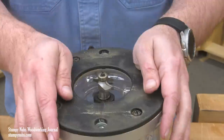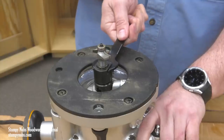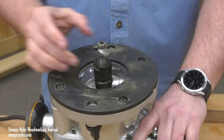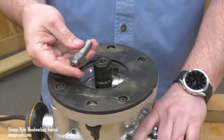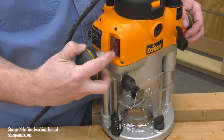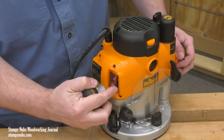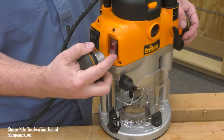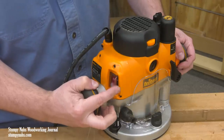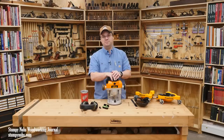There is also a built-in micro adjuster on top so you can slowly move the plunge mechanism and dial in your cut. Check this out: if you plunge fully, the collet extends to the bottom for easy access and it automatically locks, so you can change the bit with a single wrench. I have no idea why all routers don't do this — it is such a good idea. And in this position, the little safety door that covers the switch locks, so it's impossible to accidentally bump the switch and turn it on. I'm not saying that's a replacement for unplugging the tool when you change the bit, but it is a handy safety feature for those who don't always remember.